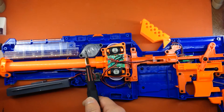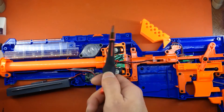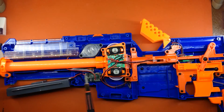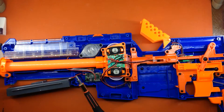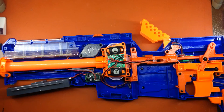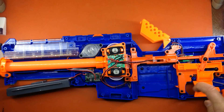This is a half-watt speaker, which is kind of junk, but if you try and upgrade it with a 1 watt, 1.5, or even a 2 watt speaker, since this card does not drive the circuit with enough power, you will not be taking advantage of that upgraded speaker. I've actually tried this with a 1.5 watt speaker and the sound was actually less than this tinny little speaker here. So without that modification, don't even bother.